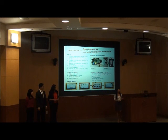We started out using a remote control for a TV, and that worked perfectly, but to program the IR to send a pulse at the particular frequency that the receiver would receive was a little bit challenging. We programmed in micro C to overcome that challenge. We had another challenge when we were programming the database and setting up the server, and that took a lot of time.